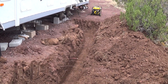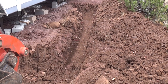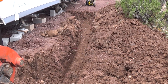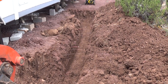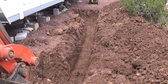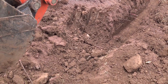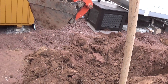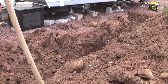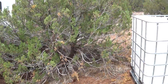What's going to happen is, when we lay down the water line, it's got to be 24 inches deep — and that's what this trench is, roughly. So the water line will go in here, then we'll bury the water line and go up a few inches. Then to the left side — the trailer side — will run the propane. You'll see both lines running over by the barn: one propane, one water. When you lay down the propane, you won't even see the water because the water will already be covered up.